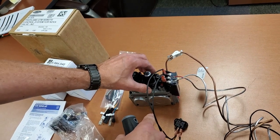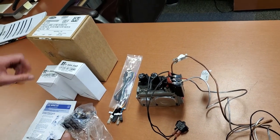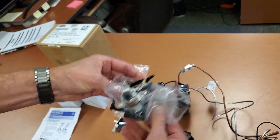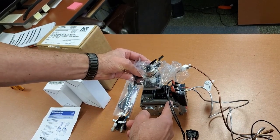Whenever you take a regulator off, make sure you go all the way down to bare metal. There are little gaskets and little plastic pieces — get all that cleared out of there. Then open up the new regulator from the package and put it on exactly like the other one. The manual high-low knob comes off and the stepper motor just replaces it.